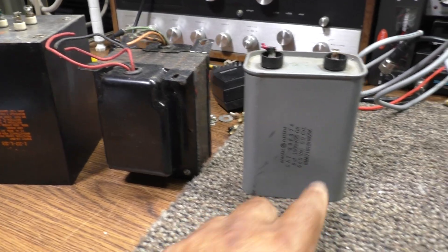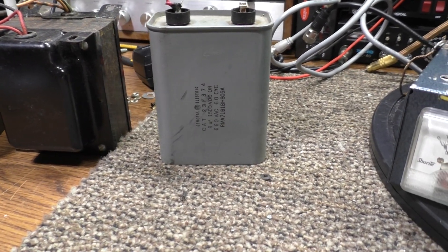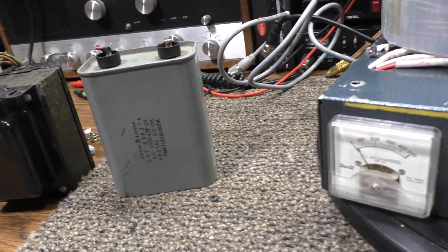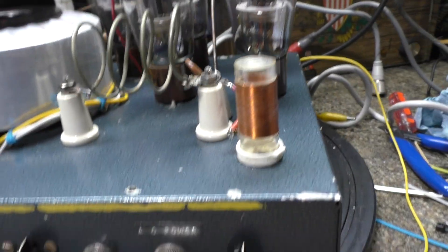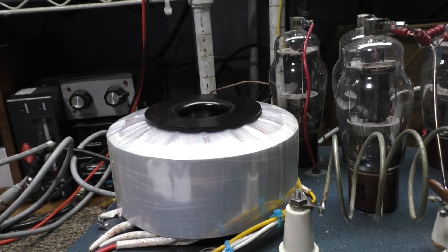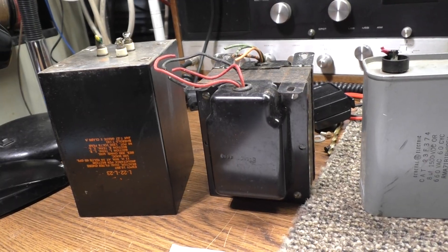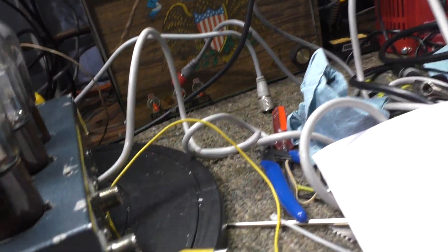At the end of the swinging choke was the oil-filled capacitor, so they used both to filter the AC and turn it into DC. I replaced both with two modern 450-volt electrolytic capacitors. I got a toroid transformer with the correct voltage, because the swinging choke actually drops the high voltage, whereas a capacitor bank adds to it.